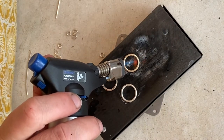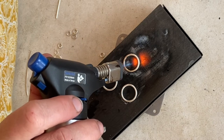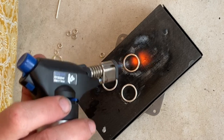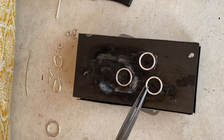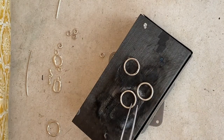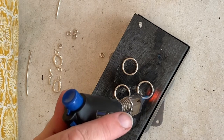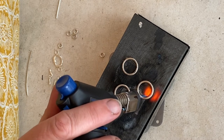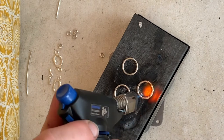And we'll do it on this one. Now I may possibly have left a bit of a big gap in this one. I think part of the jump ring was touching so hopefully we'll be okay. The metal's just coming up to temperature now — you can see the surface is changing and it's just starting to flow. There wasn't too big a gap so I'll just come round the other side. I'm just going to flip them over just to make sure they've gone all the way through. Those look pretty good but just to be on the safe side, I will give them a quick once over again because that one I can still see a little bit of a line. So we'll just bring this back up to temperature. It's easier to rectify anything at this stage than if you get a split further down the line. So that's flowed.